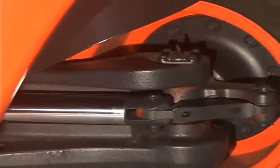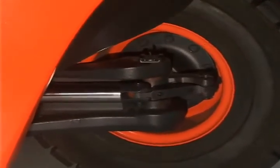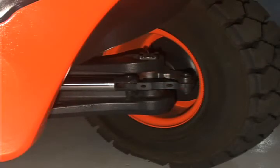A better approach is to rely on short, solid steel forged steering links. These forgings require no maintenance other than regular grease and do not deform. Long term, they provide flawless steering geometry, contributing towards longer tire life and safer operating conditions.